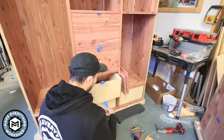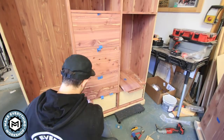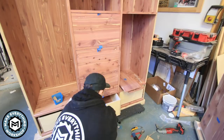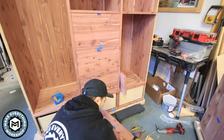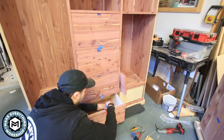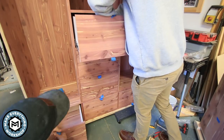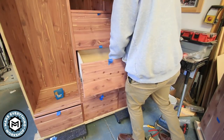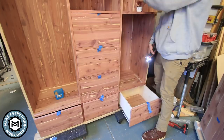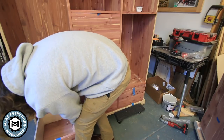The nice thing about the hot glue is I can position all these drawers and if I realize there's a problem I can always pop them off. It also streamlines the process - I hot-glue all the drawers first, then go back and screw them in from the back all at once, so there's less time putting down and picking up tools. Once the drawer fronts are installed these cabinets are basically built and we've done all we can in the shop. There are some edges off on the sides and bottom of the cabinet, but all that finishing work will be done on site.